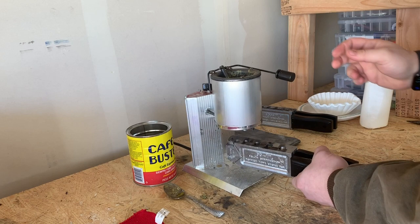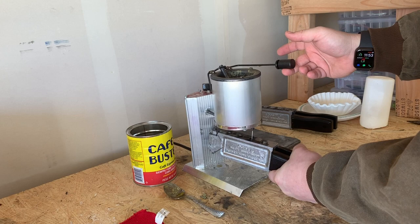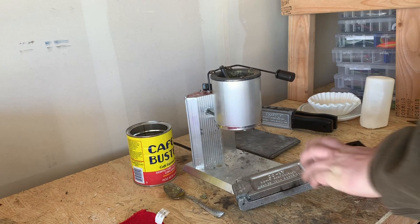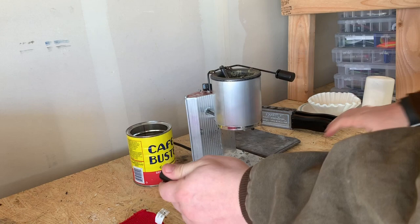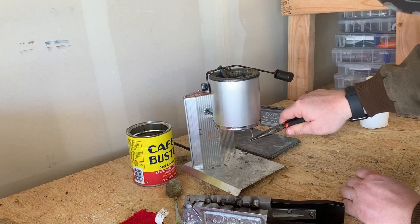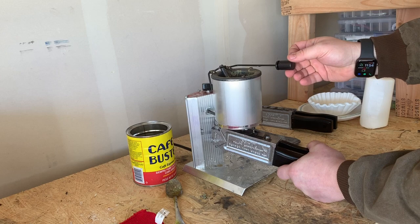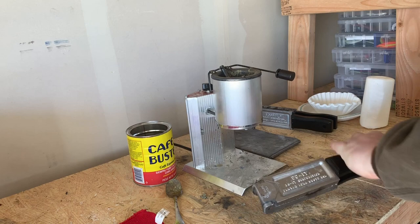Right here I'm going to start pouring lead — there are no hooks in the mold at this time, this is just to heat it up. I can see the stream is a little lackluster, so I'm going to clean my pour spout out. This is just a bent hook I use with some pliers to ream out that pour spout. See how I'm reaming it around — that'll let me pour lead a lot faster. You can see how fast that cavity fills now — that's how it should pour.